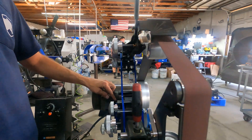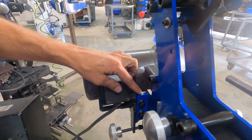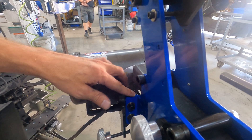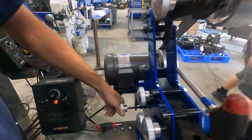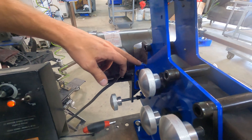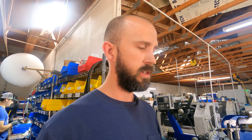If you look back here — same as in the motor alignment video — the top of the black and the top of the blue on these bent flanges should be pretty close to even on both sides. They can deviate a little, that's the point of the adjustment. You're going to use that knob to tilt it, so they won't match perfectly, but if you're having to crank it way too far, go back to the alignment video and reset. Running forward, get everything tracking straight so you don't have to go to extreme wheel angles — that causes premature wheel wear and unpredictable belt motion.